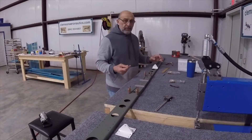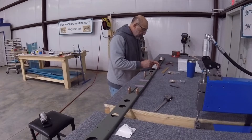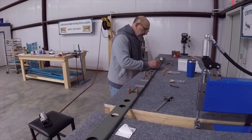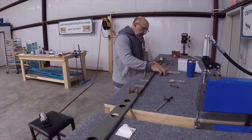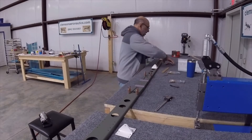One of the things that I like doing also is when I line up my hinges with this part, I try to put my number 30 drill in there to line up a little better before I cleco it in.